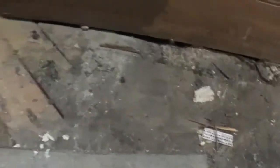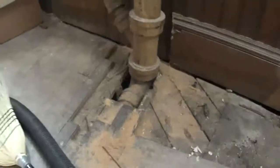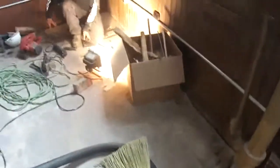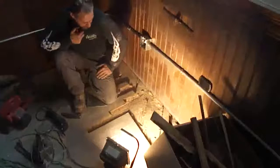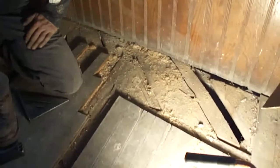Over the years you'll have some issues where boards have just warped. In some old houses or old warehouses that may not have been well maintained — that's what we have here. You've got your original subfloring and then your actual material. To reinstall, you don't want to just cut a straight spot and put in new wood — it just looks like a patch job. So I'm going to meet with George over at Adams Finished Carpentry, who's showing us the process of toothing in old finished wood and replacing it with new wood to make it a seamless project.